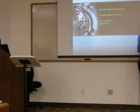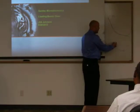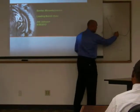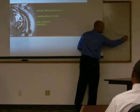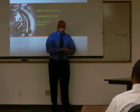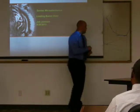We call this the bathtub curve. And it's called that because it looks like one curve, but it's made up of two different curves. The first one, like I was describing, is the early fallout, which actually trails off down to zero over time. The other one is as we age, we start increasing, and that's what creates the other side of this bathtub curve. So what we're trying to achieve is this area in the middle where it's more stable and consistent throughout the life of the product. So this process, in 24 hours, ages it to equivalent to a year.